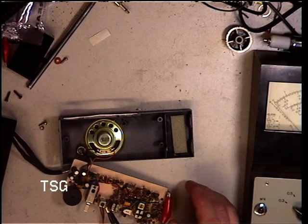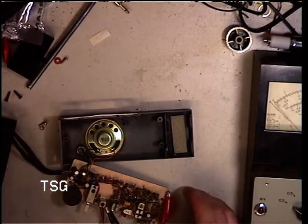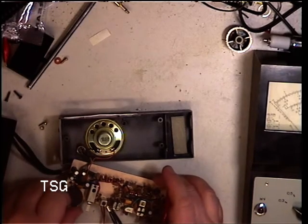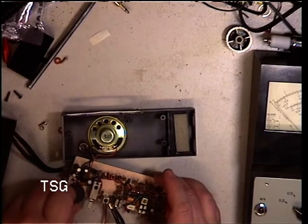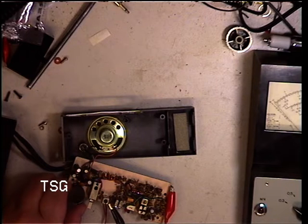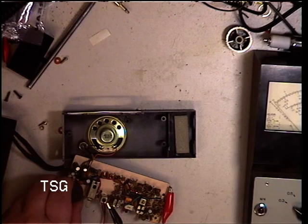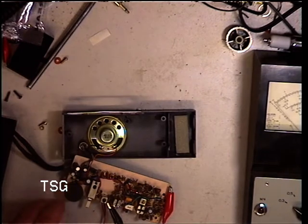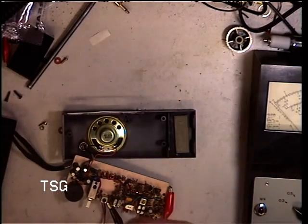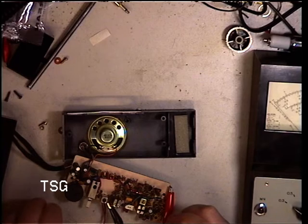After five minutes of listening to that racket, whatever the capacitor was in the amplifier has managed to reform itself. It was drawing 80 milliamps. It's on the power supply now and it's drawing 20 milliamps, which is better than the 80 milliamps it was doing. That's channel 14 off the frequency counter — that's a mind-blowing 10 microvolts receive sensitivity. There's three microvolts. Isn't that rubbish? And it's off frequency because the crystals have dropped with age, and there's no way of bringing them up because there's no adjustment for the crystals.